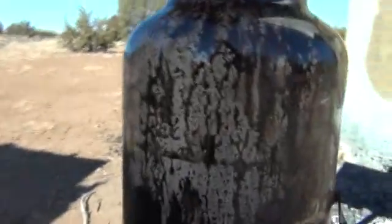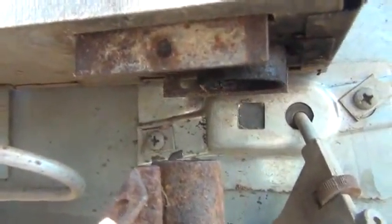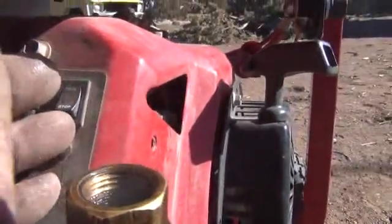Right now I want to take you into the condensation jar. You can actually see the liquids inside of there building. They're the clear liquid, not the darker colored stuff. That's a bio-crude jar that I use, so it's still stained with some bio-crude in it. But you'll notice there is a great amount of condensation happening inside our jar of our gasoline style fuel. It's nice and fogged out inside of there. And with as much as you see coming out the end, that means we're gaining most of what's in there. That's got quite a bit inside the jar and almost nothing making it out, at least nothing that's visible, which is a good sign. Let me walk you over real quickly. We should have synthetic gas production happening from our generator spout here. Also very hard to see today because of the wind. But that's actually working right now.